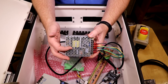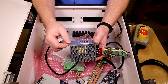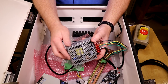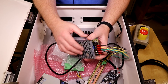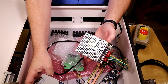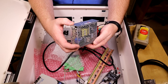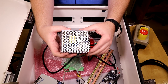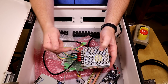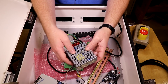That dual-voltage supply in a very small package is going to round out my electrical needs. I'll be able to run the brake with it if the draw isn't too bad, and maybe even the home sensors — though we only have one amp to play with there. The Acorn itself is running off the 24 volts, so it's already using some of that one amp. Almost assuredly I'll need to add another 24-volt power supply, but no big deal — I've got several I can use for that.